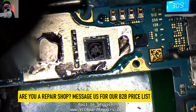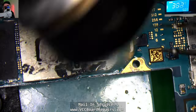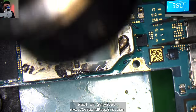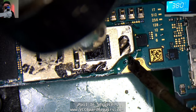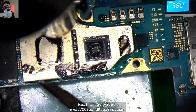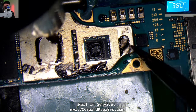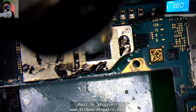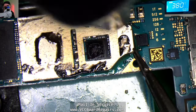I'm going to make the shield removal easier by adding some super low melt solder. This is 138°C solder wire — it allows us to decrease the melting point of the solder that's on here. The factory solder is about 222–223°C, which makes it really hard to desolder. By adding low melt, we basically lower the temperature of these solder joints but not everything else. Using the standard 380 setting, let's see how far we can get. While it's hot it's easier to spread out that solder. Oh man, this stinks — there's glue here that was holding down the little foam piece that goes here.